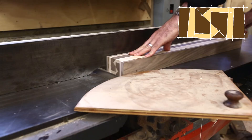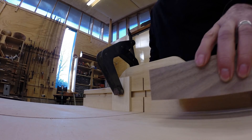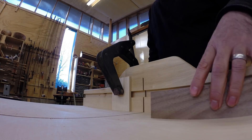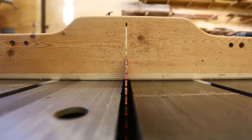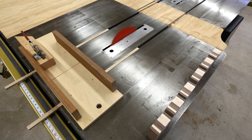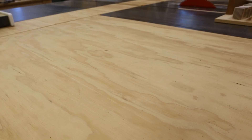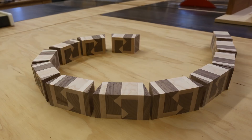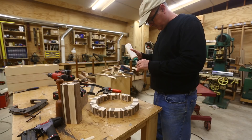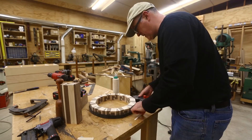Then I could joint the top and bottom of that piece. Next I had to cut the piece I had made into a bunch of little segments, which would become the segments for the bowl. I cut those at 1½ inches in length, giving a rough bowl thickness of 1½ inches. I cut out 12, as I was making a 12-segmented bowl, which meant a 15-degree angle on each side. I changed jigs and cut each side at 15 degrees. I'll glue half at a time and put a little shim in on the two halves.